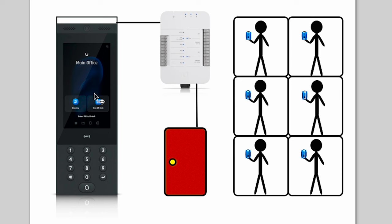There are a couple of ways of doing this. One way is to use an intercom viewer — this is the way UniFi want you to do it. Each flat would have an intercom viewer, and when someone calls, they'd answer it on the viewer in their flat. The problem is that often we'd be replacing an analog system, so every cable already installed is useless. We'd need to install new Cat6 or data cabling into each flat, back to a network switch for PoE, and then to the network. On six flats it wouldn't be too bad, but 60 flats is an awful lot of work and cost — equipment, labor — it gets very expensive very quickly.